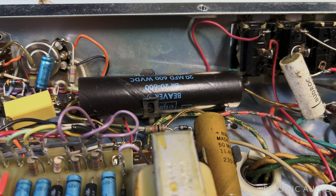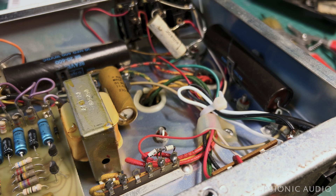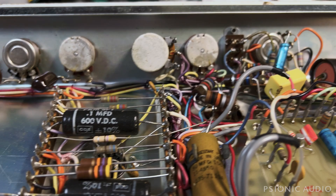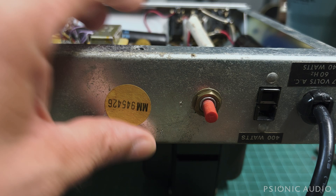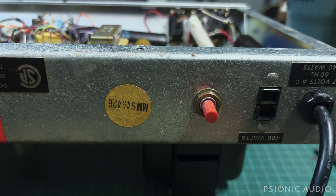There are a lot of caps in this amp that need to be replaced, and that's something I'll talk to the owner about because it's all doable. But at the end of the day, you can sink a lot of money into getting one of these restored, and I'm not sure that the payoff is there. I measured the circuit breaker — zero ohms and it breaks — but it mechanically sounds noisy, like parts are moving more than they should. I don't trust it.